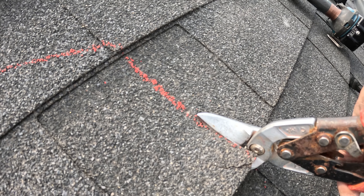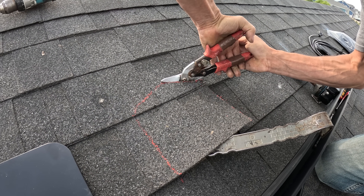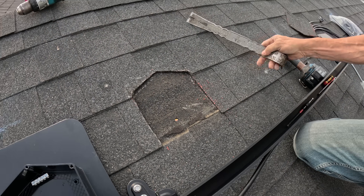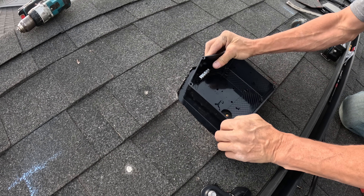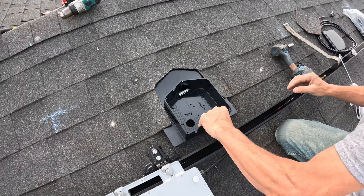Because this whole system is going to be installed through a wall outlet, there is a limit to how much solar you can install on a single circuit. Your home wiring is an important factor, and if you have an older home, you definitely want to have a professional come and make sure the wires are thick enough to handle the full 1200 watts.